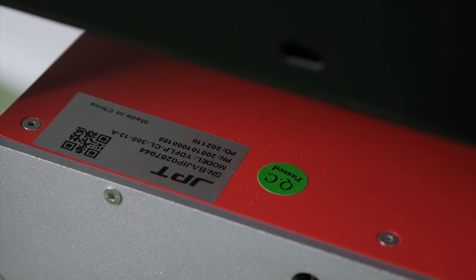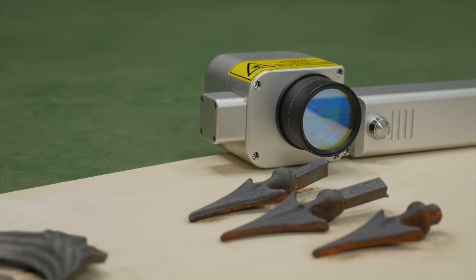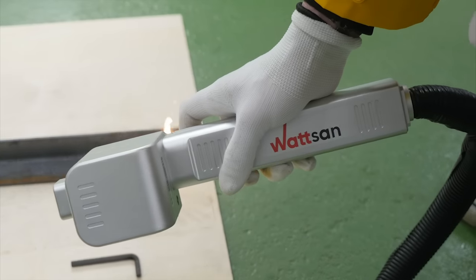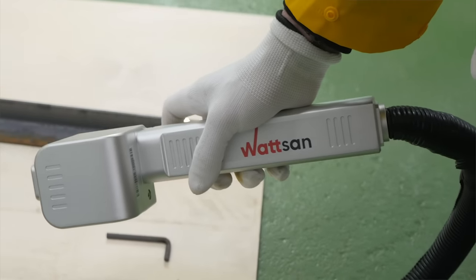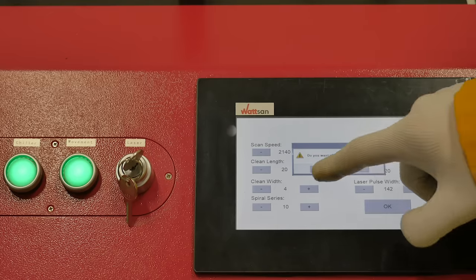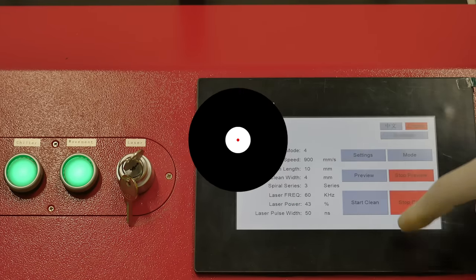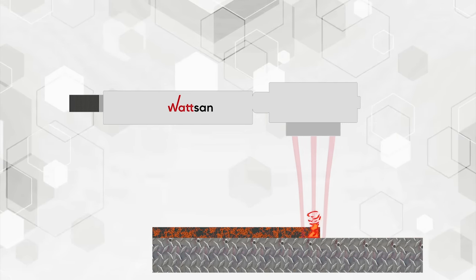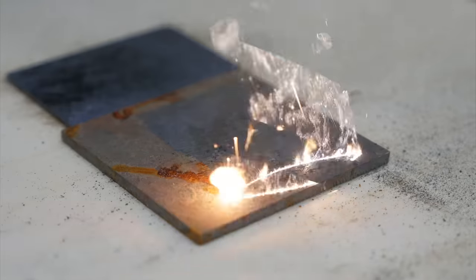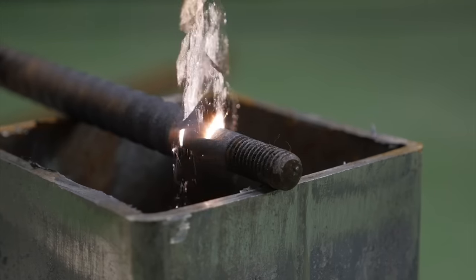The scanner contains a lens which focuses the laser beam. The focal distance can be adjusted manually by positioning the scanner in relation to the surface to be cleaned, allowing you to reach even the most hard-to-reach places. All settings and parameters are set on the touchscreen and via buttons on the scanner. When the laser beam hits the surface of the material, it is absorbed by the surface layer and destroys it. The key is to choose settings that do not damage the base material while still affecting the layer to be removed.